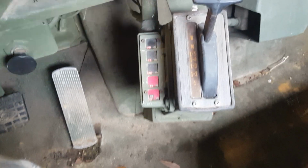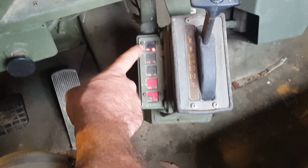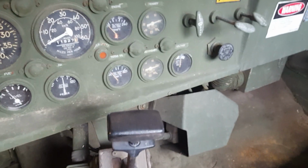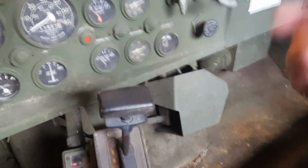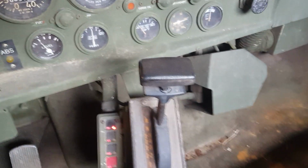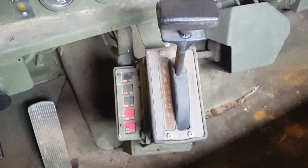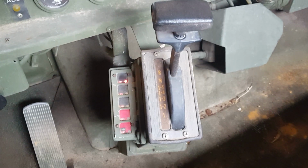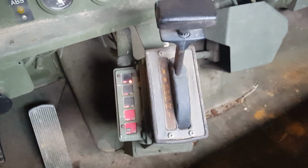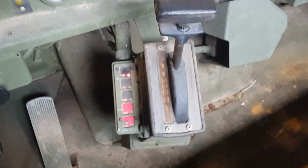Now a lot of times what you'll run into with these trucks, especially if they've got leaky tires, which they all do, is it'll try to reach this certain pressure, and keep in mind it only starts airing up the tires once both of your pressures here have reached 120 psi. It will not put pressure. You hear that? And now it's starting to air up. But it will not start airing tires until you've reached 120 on your primary and your secondary tanks. So what it'll do is it will air and air and air, and if it decides, okay, I put so much air to it and I'm still not seeing the pressure I want, it gives up. And it sounds like a dying elephant. You'll hear a big burst of air with a dying elephant sound, and then all of your lights will start flashing at the same time. You hear that? Now it's reached the proper pressure, and it's done, and it blew off its test pressure.